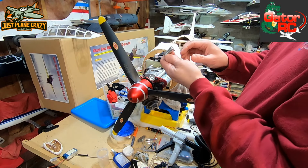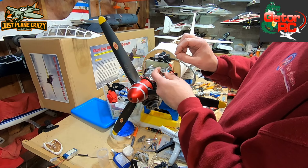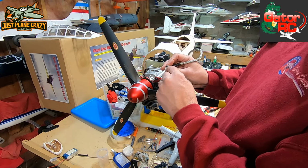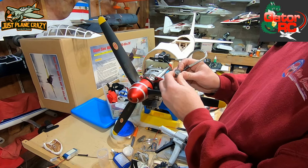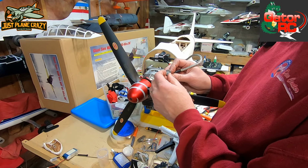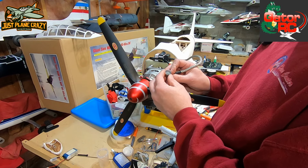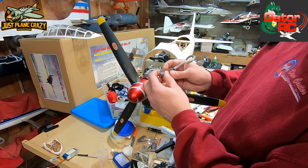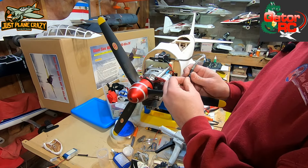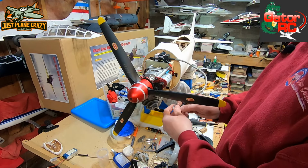Now when it comes down to your ignition wire, it's going to have that rubber boot in there. I typically take a little dielectric compound you can find at any hobby store or any automotive store, and simply place a small film on the inside of there. Dielectric film or dielectric grease is actually like an electrical insulator realistically, but we put a little bit in there to help reduce moisture and spark jump, but also to make it possible that after this thing's been cooking on that engine for a couple years, it will actually come off. I try and change my spark plugs yearly because they don't cost much and it keeps the engine running well. So we'll put a little bit of dielectric grease on there.